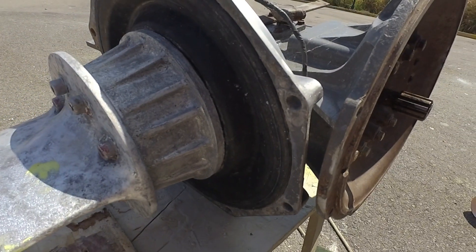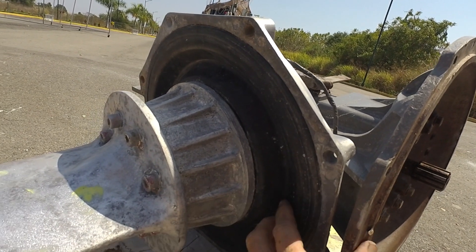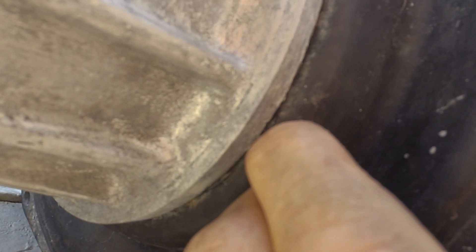I'm just frustrated. We took the saildrive out because I wanted to inspect the seal — the diaphragm — and it looked pretty alright when I felt it. But today I actually found cracks; there's a pretty deep one and another one there. It's so expensive to replace — if I'm going to replace these two seals, that's $700 with shipping and VAT. I just don't want to put any more money into this. I gave my diesel tank away last season because we thought we were doing the electric conversion, so this season I have to have a new one made — probably $500–600.